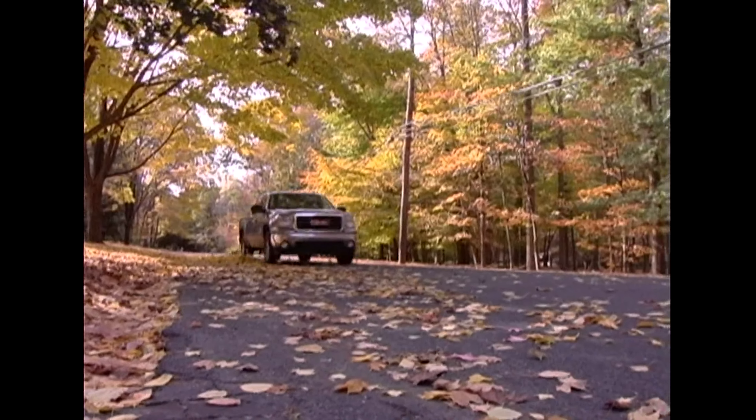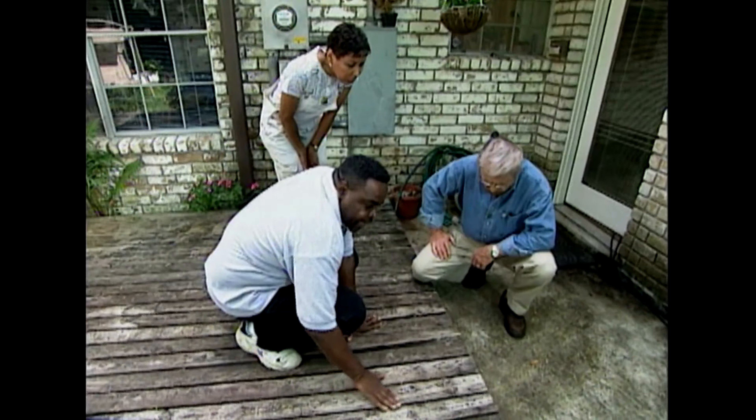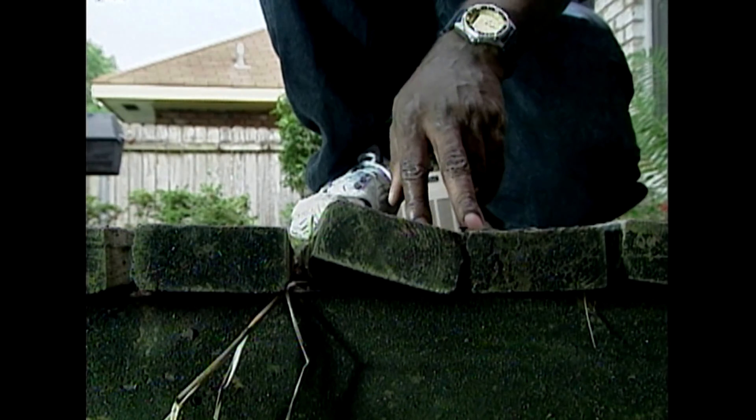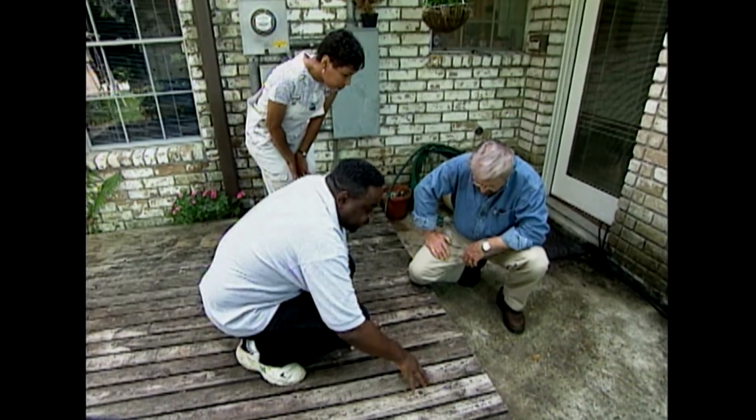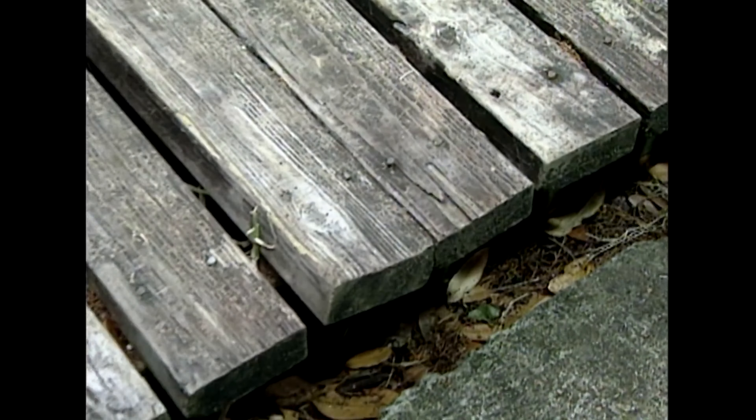Kenneth and Andretta Allen of New Orleans, Louisiana asked for a little help, so I'm going to pay them a house call. At first glance it doesn't look good — the deck boards are splintered and have faded to a dingy shade of gray. Some boards have actually twisted out of place, and nail heads are popping up all over. Things look pretty bad, but I'm fairly confident a revival is possible. The popping nails, cracks, and twisting lumber are all caused by the wood getting wet, soaking up water, expanding, and then drying out and contracting. That continual movement causes almost all of these problems, and the way to prevent it is to put a good sealer on your deck every year or two.